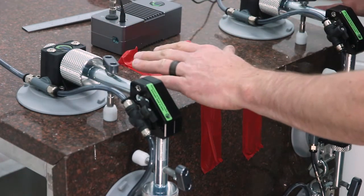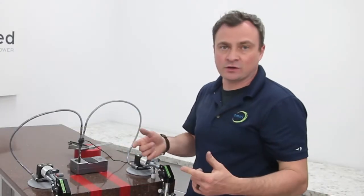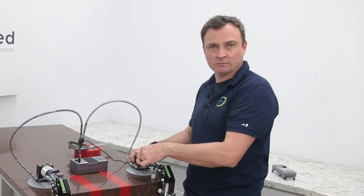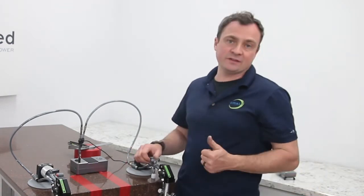And this will lock these in parallel to the top. Again, not too much, just make it touch and then another half turn, that's all it takes. And if you've done it right, these rollers should move smoothly and not feel bound up. These are good. Now, before getting out an adhesive, let's dry fit this seam.